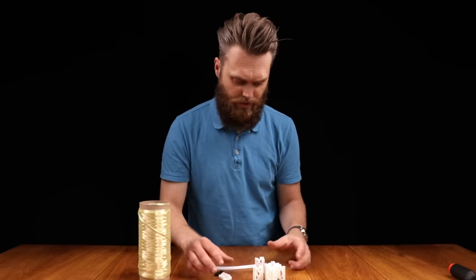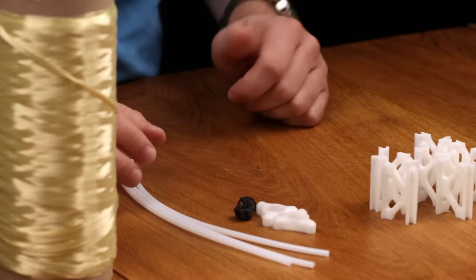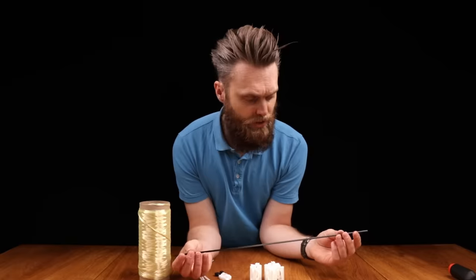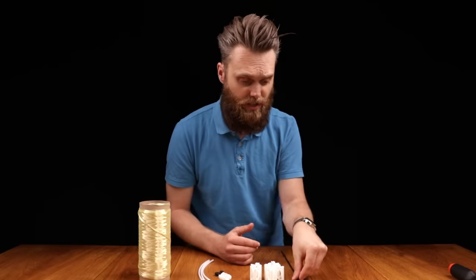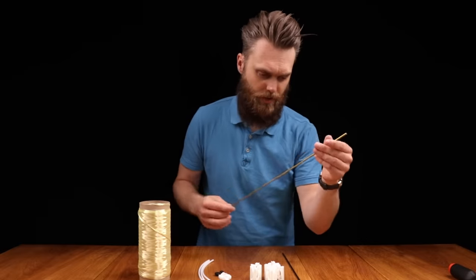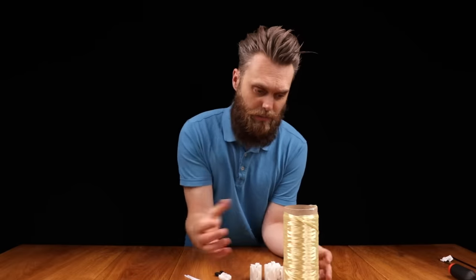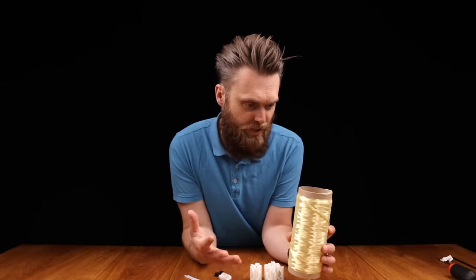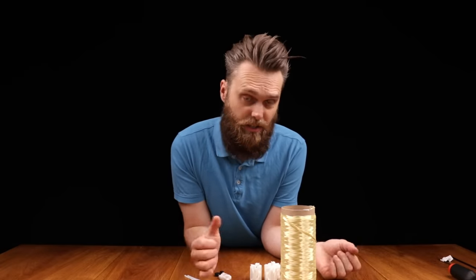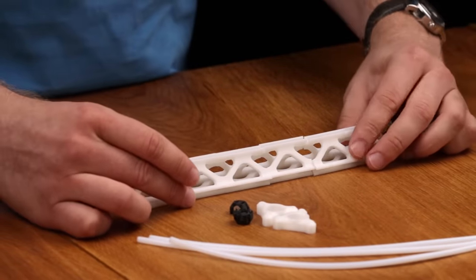And depending on the materials used, we can go cheap with this PLA and just these PTFE tubes. We can go high performance with this 4mm carbon fiber tube and use better materials like polycarbonate or nylon, or we can go fancy and use this brass tube. We can use different fibers besides Kevlar, but this is actually quite affordable. Most important thing is that it doesn't stretch, and well, Kevlar is a quite good material for that. So let's quickly put one together.